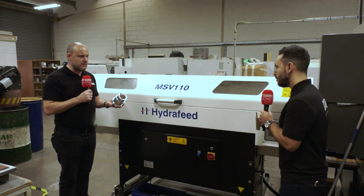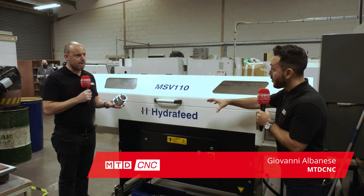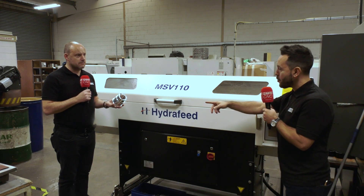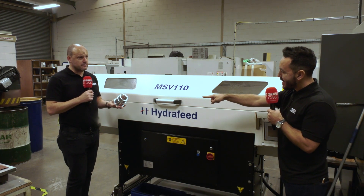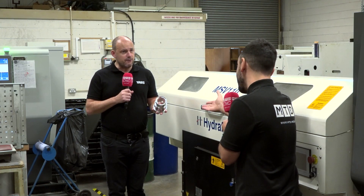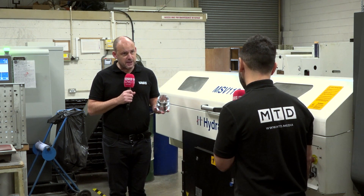They're obviously achieving it. I don't think it's tricky, but I think it is quite uncommon. You don't usually see large bar over 100 mil being bar fed. That's 101 mil for that optical component there. And you can actually see the actual material removal that's coming out of that particular component — there's virtually nothing left, probably less than 10% of the material left.